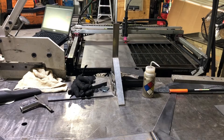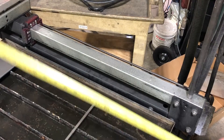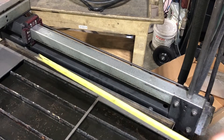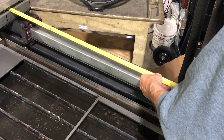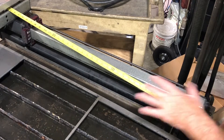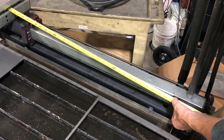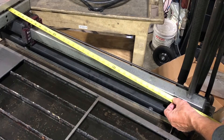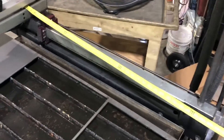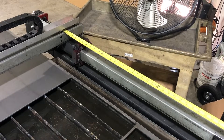Let me take you over there and show you what I found. I'm on one side of the machine — if I'm facing the torch, I'll say I'm at the front of the machine. I've just parked the X axis and I am measuring to the edge of this block. These four corners are straight, so I'm comfortable using these corners. You can see the edge of this bracket is right at 34 inches. I'm hooked over the edge of the rail — hooked the backside of that X axis rail.